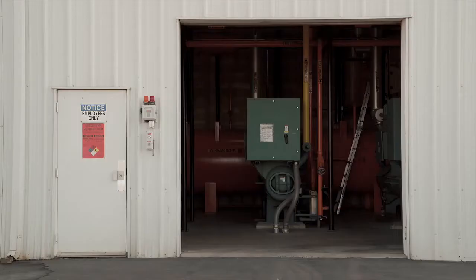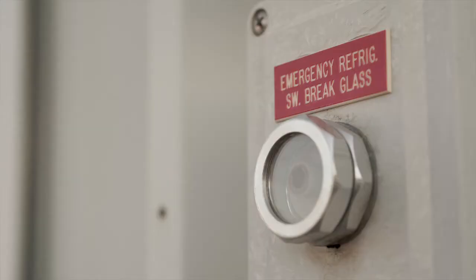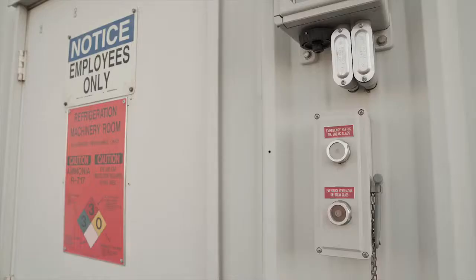There are a variety of e-stop switch types, such as the break glass type, which has been widely used for decades. The purpose of an e-stop is easy to understand. In an emergency, it is advantageous to have a single location to de-energize the refrigeration equipment from a safe location outside the machinery room. E-stop provides that safe location.